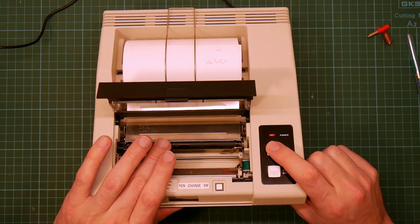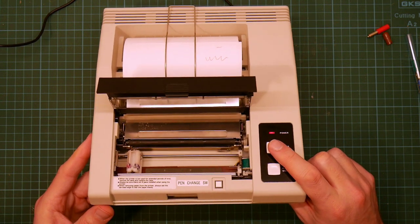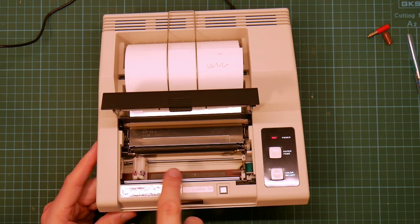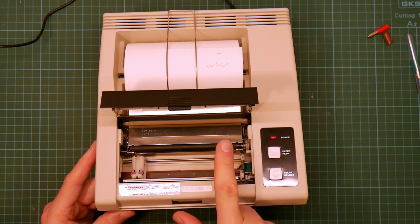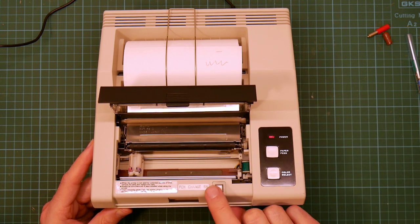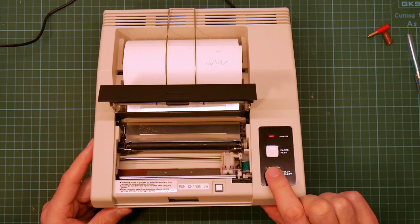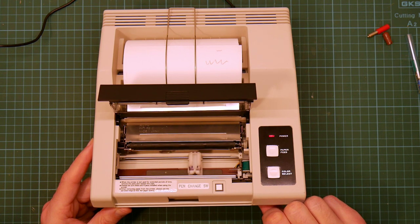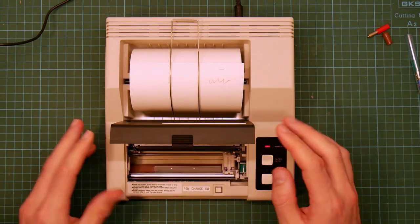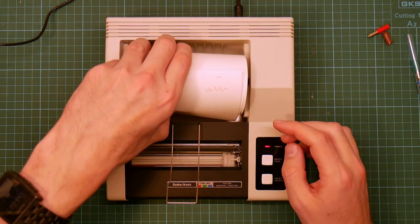In fact it seems to want to move a little, which is odd, and you can notice there is in fact a noise being made. Some of this is coming from the stepper motor that drives the printhead, but some of it's coming from the stepper motor that drives the roller, and I'm not entirely sure why. I can tell it to move the pen to the right — that's nice and smooth — back to the left again, and that tries to change heads, so that one's working all right. But there's something wrong with the paper feed mechanism, so I'm going to take this thing apart and actually find out what's wrong.